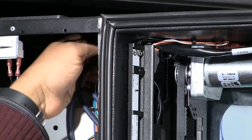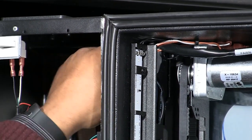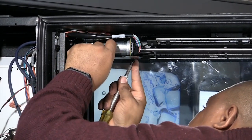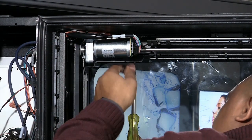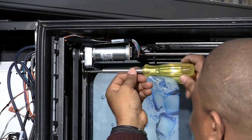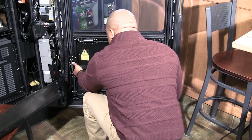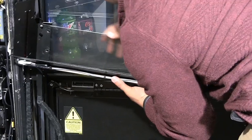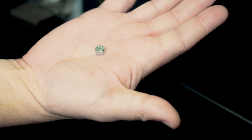Please separate red and blue motor drive wires away from the existing encoder wires to eliminate possible transmission interference. Then reinstall the motor cover. Ensure the belt holders are aligned, then raise belt heights to a comfortable working level. Reinstall the elevator bin assembly with number eight nylock nuts and not the acorn nuts that you removed earlier.